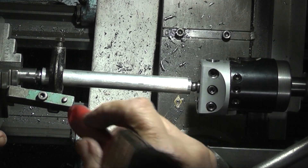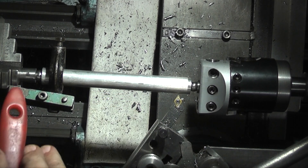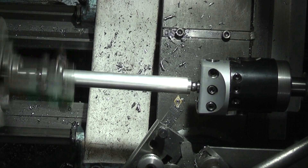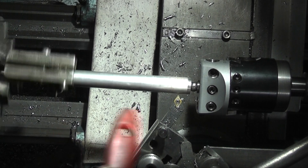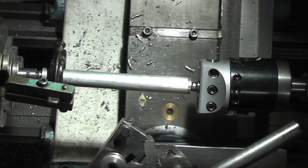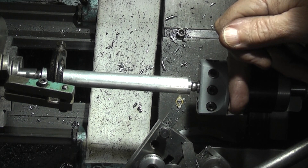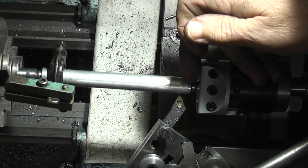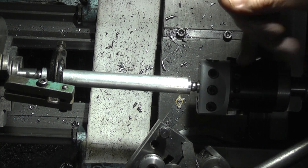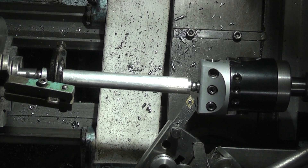Because my driving dog is straight, I've had to clamp this one on to give me the drive off the chuck. So now I've got the drive off the chuck going through the bar, and as you can see the bar is offset because I've moved the boring head across to give me the offset. Now I can turn this and then adjust it with the boring head to give me the correct taper. I'll just turn a little bit because I might want to use that bar for something else.